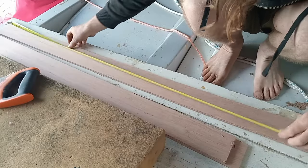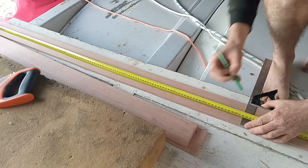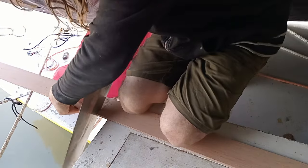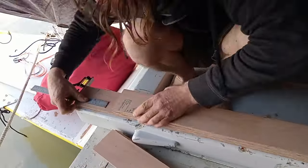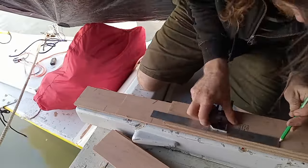And of course it's lighter and takes up less space. I don't actually need to cut out plywood very often, so I think a handsaw is just a better option in this case. I cut six strips. A piece of plywood is 2.4 metres long, but the beam needs to be over three metres, so I cut two of my strips in half to get eight strips, and scarfing those together will give me a beam that's three metres and a bit long.